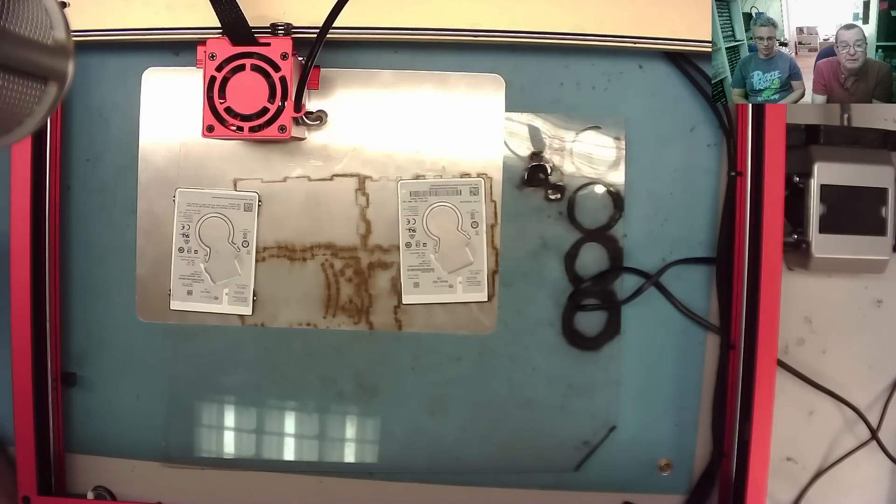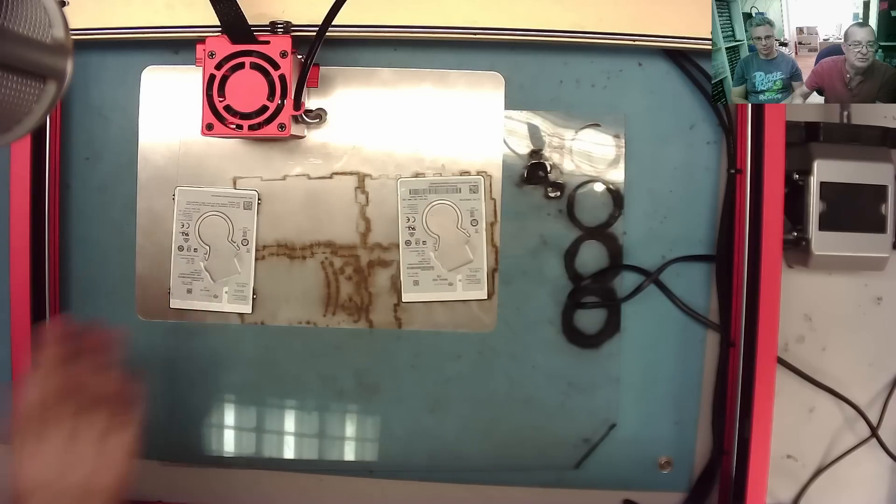The other thing we didn't try last time was to switch the air assist on, which blows the smoke away. We tried it on plywood and found it gave a much cleaner cut with less burning. I also have another idea — maybe we can try some Sharpie to darken the acrylic, so it has a colour to adhere to, since laser light goes right through clear stuff.